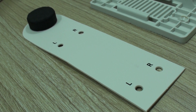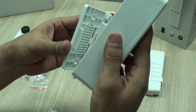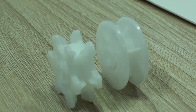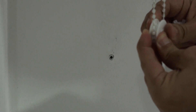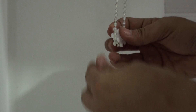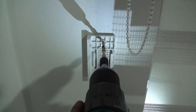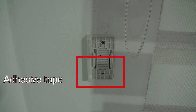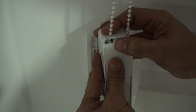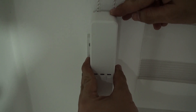After we install it, very easily using the template as a guide so that we have the appropriate length, it is important to correctly choose which one of the gears we're going to use. We might want to check this carefully by simulating the motion that pulls the rope. For this particular model of zebra blinds, this one worked perfectly. After securing it to the wall with a single anchor and the help of the included tape, we discovered that the unit has a fantastic mechanism to adjust it to the proper rope tension.